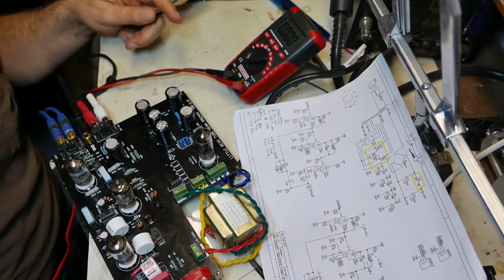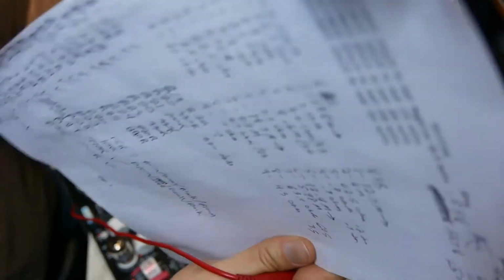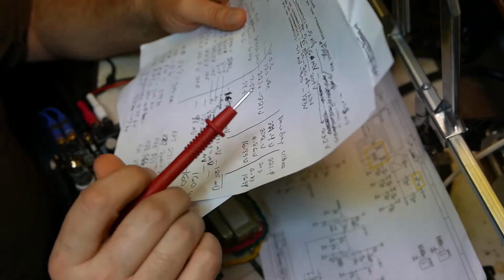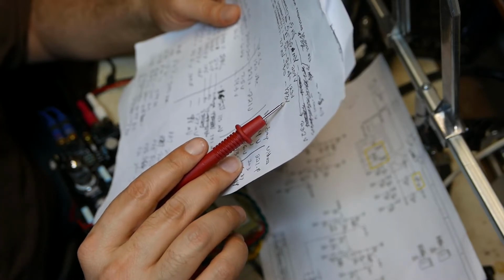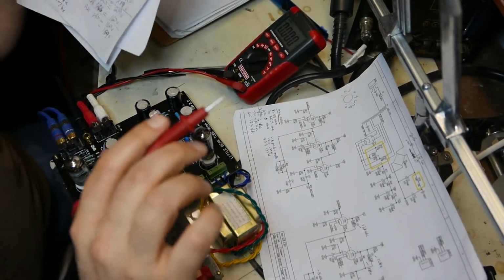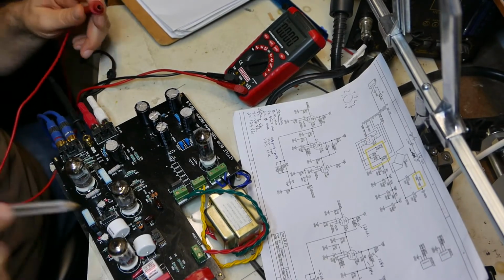Whew. Well, this is the first time I've ever seen these capacitors not measure anything, because I measured them before several times as requested, and I measured where'd they go? Oh, here they are. 232 volts at C3, 204 volts at C4, 123 volts at C5, and 123 volts at C6. But other times I didn't get any measurements either, because I keep doing the same measurements over and over again, because I'm not sure what's going on. So the only difference this time is I got my negative probe in the ground lug instead of clipped over here on the trace.